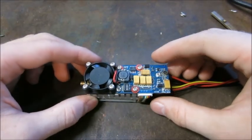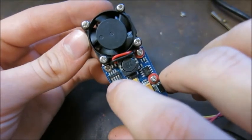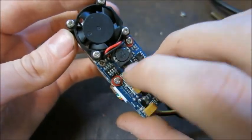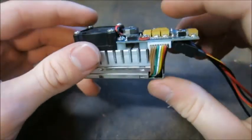This unit operates on 5.8 gigahertz. There are dip switches on the unit that let you set the frequency, so if you have an AV receiver that's 5.8 GHz, you can tune it in. One way or another you can tune your receiver to match, and if you're running multiple channels you can set those switches and you'll be good to go.